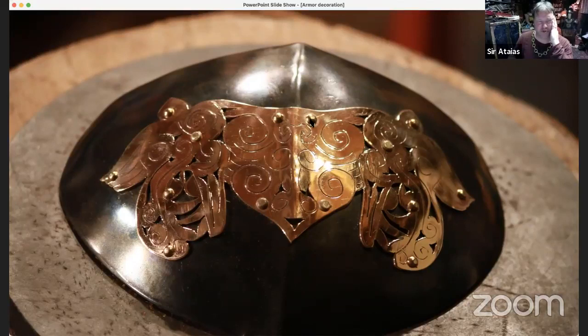Sometimes these particular escutcheon pins are harder than I want them to be, so I want them to mushroom out in the way that I would like. In this particular case, it doesn't matter so much. I'm okay with the surfaces not being domed. I've still flattened the top of them at least a little bit, because I have not made a proper set that accommodates that dome and would keep it nice and domed. I would suggest making such a thing. I just haven't done it yet.